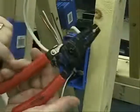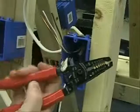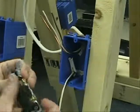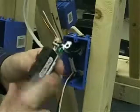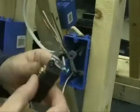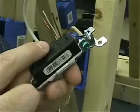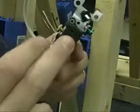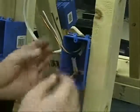You can see it's got a little locking mechanism on it. All you do is gently squeeze to release it and push it out like so. You might wonder how much insulation you should strip off — that's a good question because you don't want too much or too little. On the back of pretty much every single light switch or electrical outlet, there's a strip gauge. That's a good guide for how much to remove.